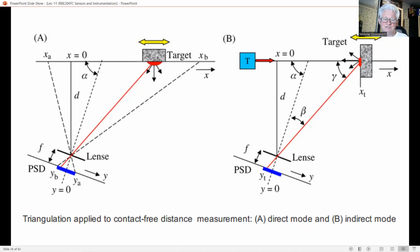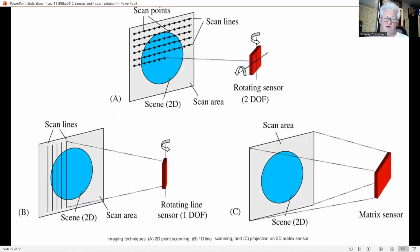Evidently, due to self-occlusion, only that part of the surface that is in direct sight of both the transmitter and the receiver can be investigated. Optical range finding, some call it 2.5D imaging, is also frequently applied in robotics, for instance to obtain information about the robot's environment for navigation purposes, automatically guided vehicles, and many other tasks. Navigation by ranging is discussed in the next section.